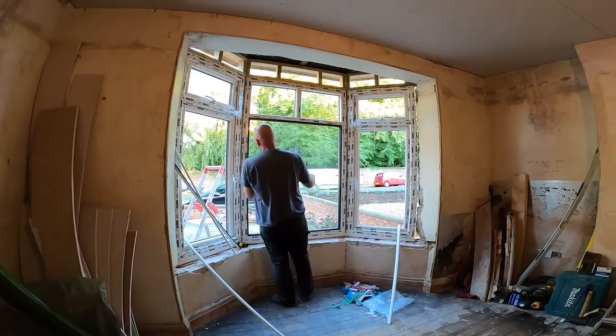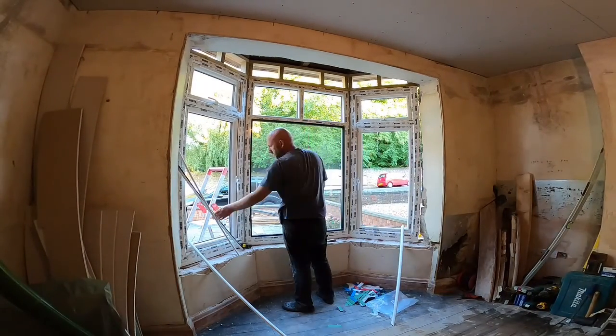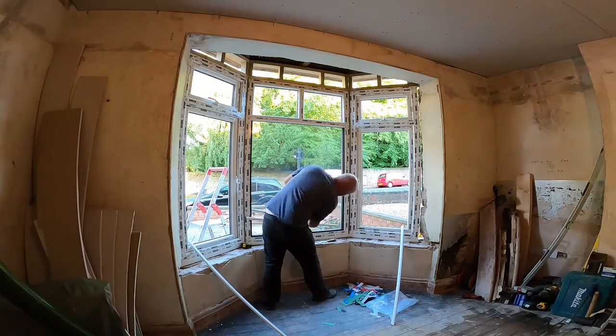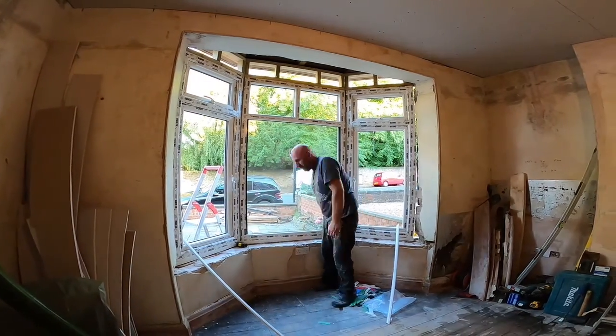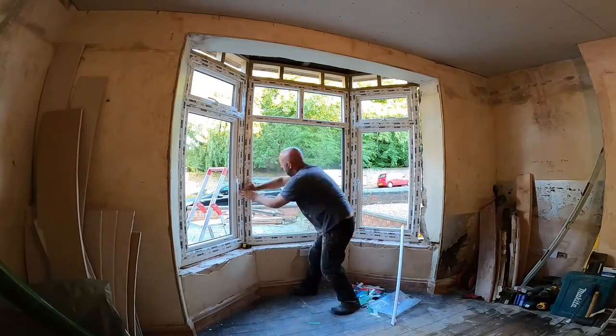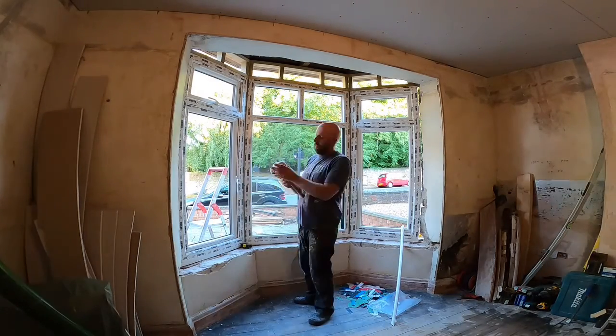Line the glass up with the rubber seal, so look to make sure it looks even all the way around. And then put the trim back in. The trim does go in a certain order, so just watch how you take it out and make sure you put it back in the same way. It just pushes in with a firm push or a rubber mallet, which gently gets the trim back in.